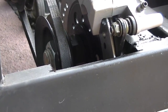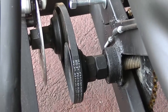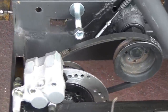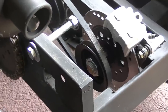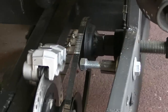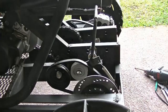I have the brakes set up so that on the handlebars on the front you have a brake on the right and a brake on the left. If you have both brakes together the vehicle will stop, because it's using a scooter motor and transmission so it won't stall. As long as the steering is in a straight line, tension will be on both pulleys meaning there will be traction to both rear wheels. If you steer left or right, it will release tension on one side of the belts allowing it to gradually steer, or if you turn the steering wheel and apply the brake it will rapidly turn. This is the mechanism I have right now — turning the steering wheel releases or disengages the belt in the back.